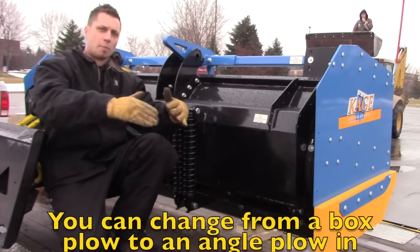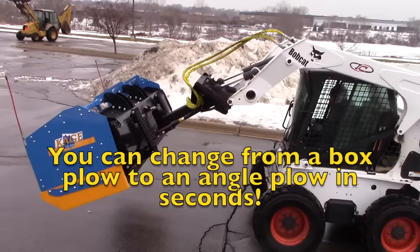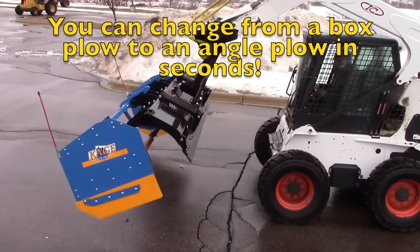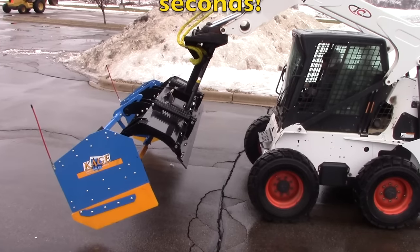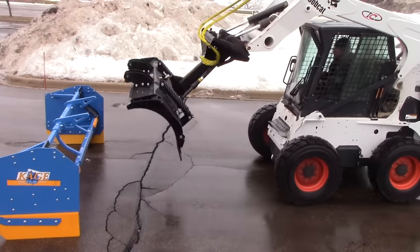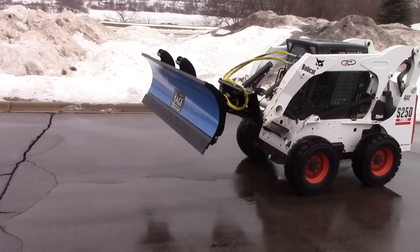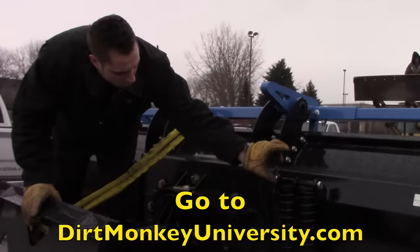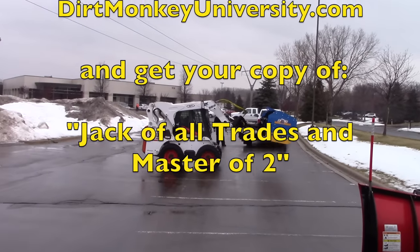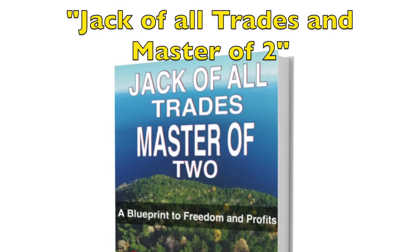You can scrape and put down pressure on that trip edge. The trip edge doesn't trip frequently, chattering across the pavement, so you lose your snow. The compression-style springs are important to understand — they're not the hook-style extension springs, so they don't wear out prematurely.